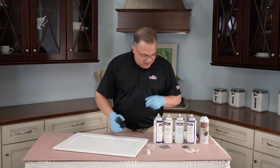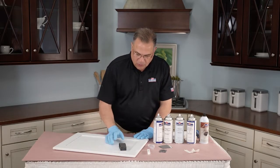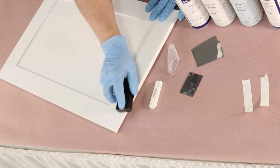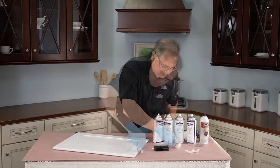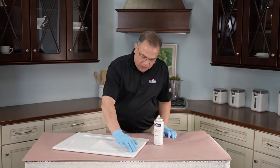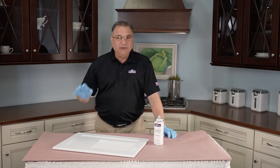I'm not going to be rough with it — I'm going to level one side at a time. I'm going to put the grater right on top and drag it back, and keep doing that until it's level on one side. My next step will be to sand on one side, sand on the other side. We have the broken corner sanded and shaped properly. What we have to do now is remember all those little sanding marks that we created — we want to seal those and fill those in, and make sure that the fill also gets sealed in.